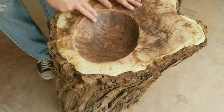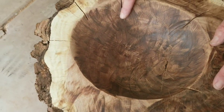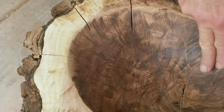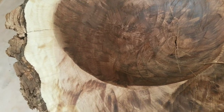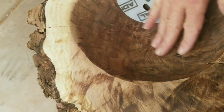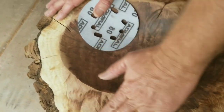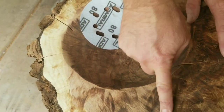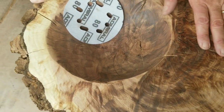I think I've done all I can with the heavy duty grinder. There are a couple of slits and errant saw marks I'm going to fill with wood putty. There are also some marks from the 36, 60, and 120 grit discs, so I'm going to take some 80 grit sandpaper and hand-sand these little grooves out to get it as smooth as possible. I've already smoothed off the top — it's pretty flat. These little tiny cracks I'll try to fill with putty so they won't print through when doing aluminum forming.